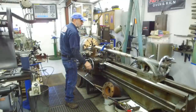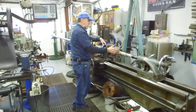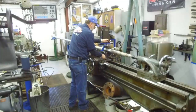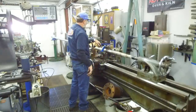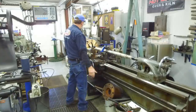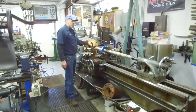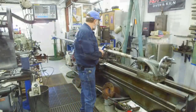All right, we're set now. Now we're gonna go ahead and we'll move our gantry over here, lift the tailstock, and then we just loosen this up here. We'll leave it right in that area, tightened down. We'll push this in the steady rest. We'll just push right down the ways until we get the working area out here where we wanna see it, and then we'll set it up, redial it, and then we'll start cutting it.